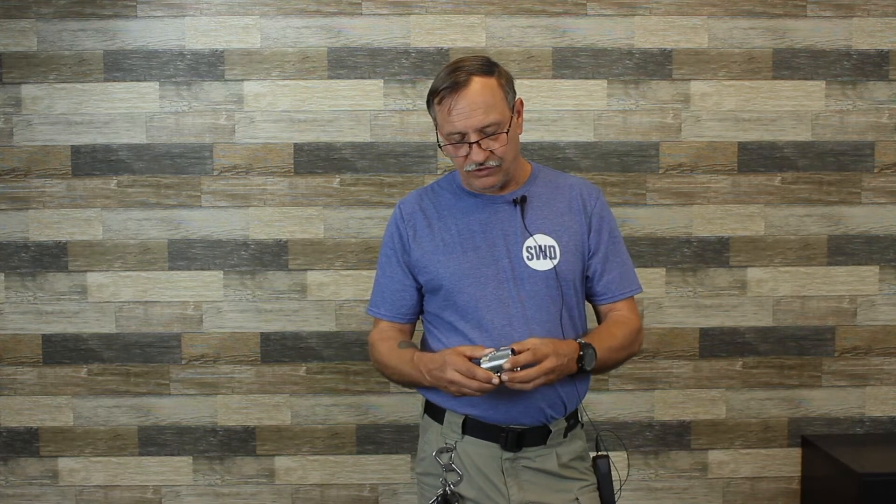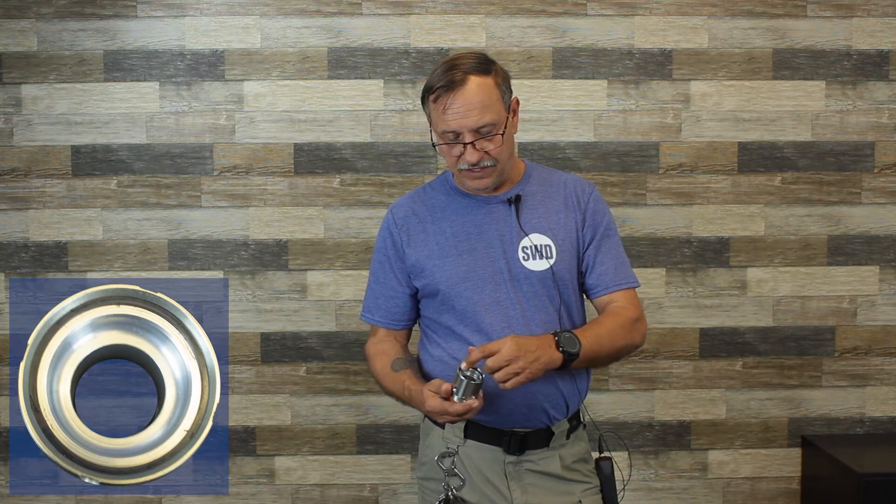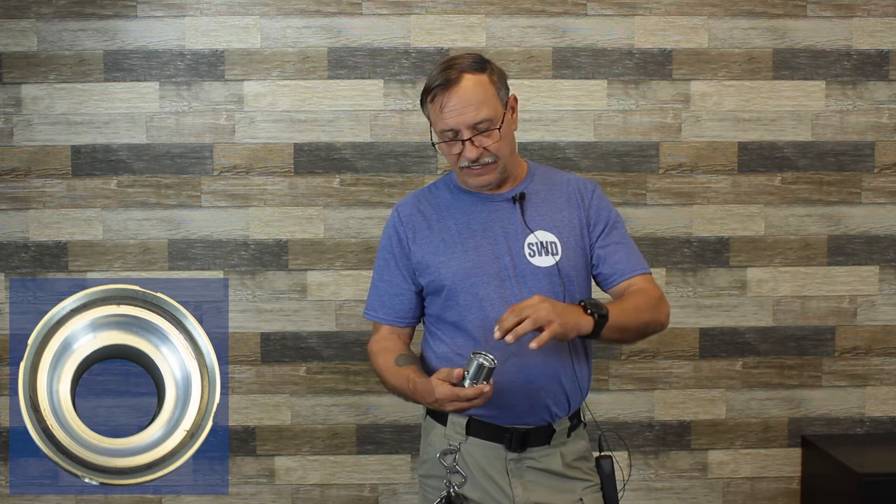One of the main issues people are doing is when they put these plugs in or the fittings in, they screw them until they bottom out. If you bottom that fitting out, this spring actuated pump can't work properly because that gets depressed — it hits that and it bends it. Once you bend it, you have to buy a new one.